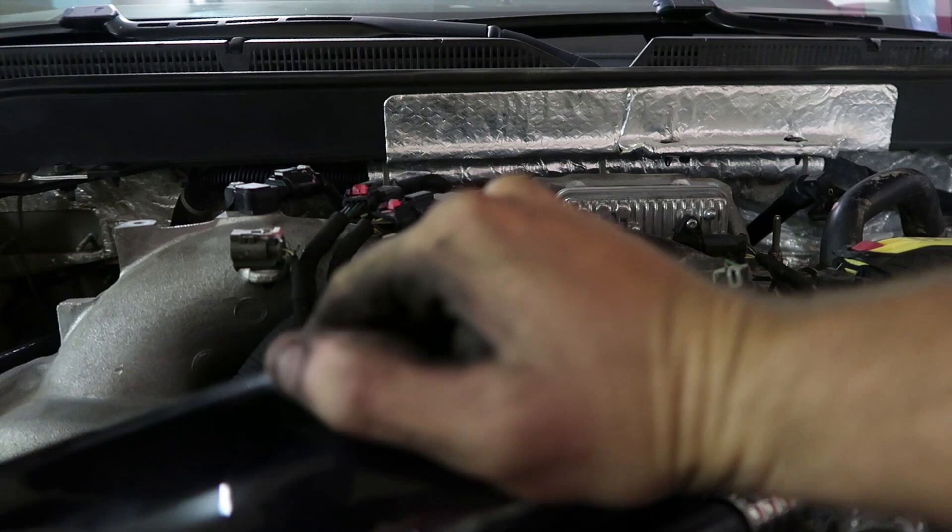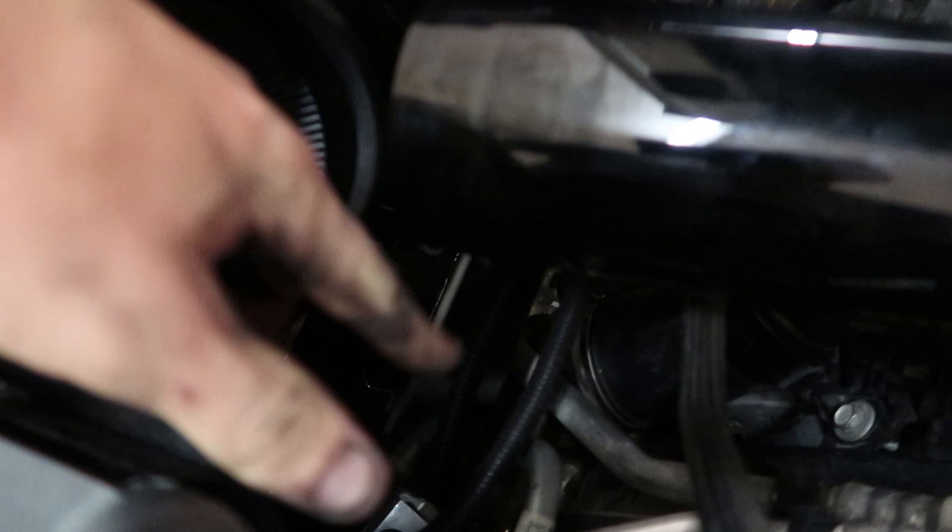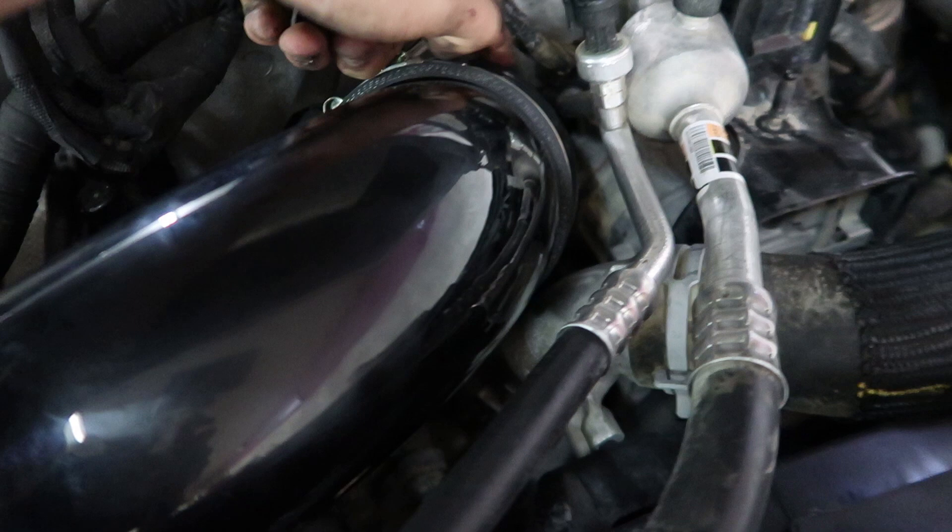That's how it's looking right now. We'll get our filter attached right here into the box. Now we've got this on — clamp tight. Last thing is to take our filter — leave about two or three inches here for the filter to slide on. Everything just fits really perfectly up in here. Make sure it's perfectly aligned to the box. Always put the clamp on before you slide the boot on, because it's a pain to get over the hump.